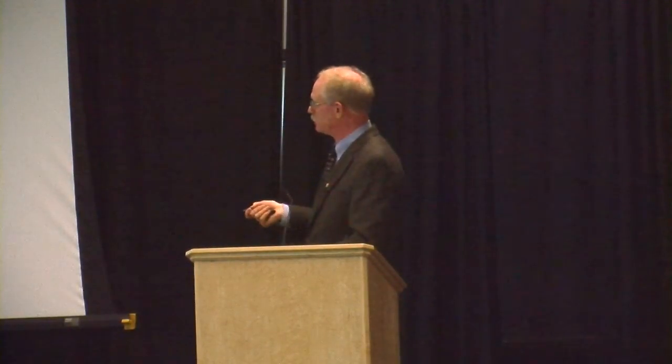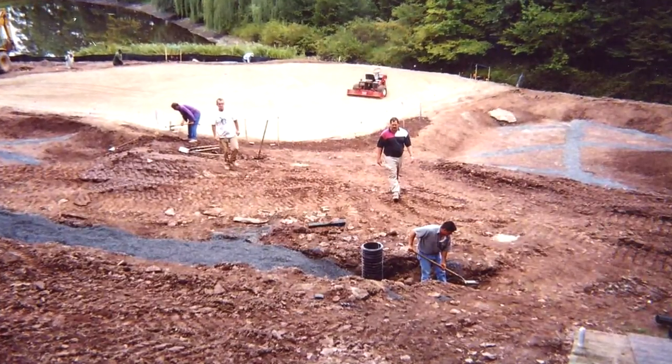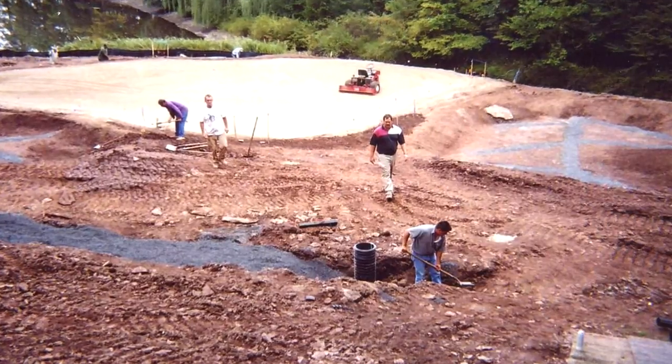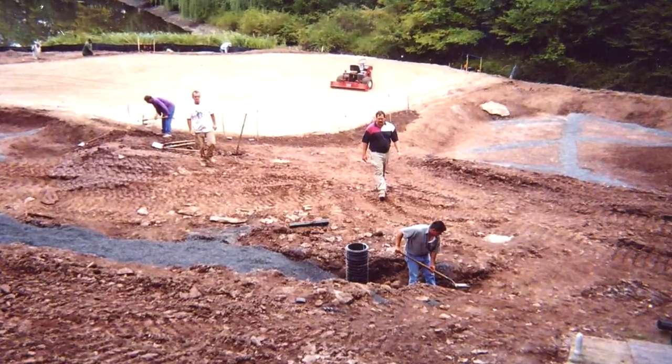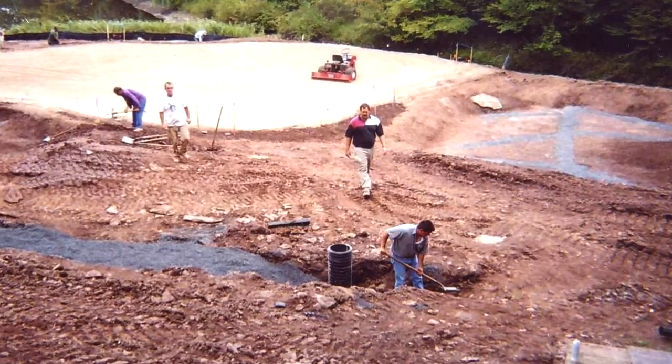Ed McCoy talked about the slope interceptors, or we call them curtain drains, and that's what's going in over this green site that's being entirely rebuilt. Bunkers, green, everything. And this inlet's going to capture a lot of water near the steps coming way downhill into this green site. And the interceptor drain in this case, and what we usually like to see. This is important, because what you invest here is going to save you money down here. So 20 mil, 30 mil plastic under the bottom of the trench and right up the downhill side of it, near the top, fill it with stone and cover it with soil.